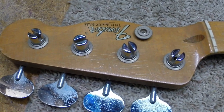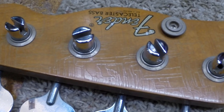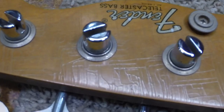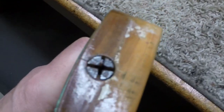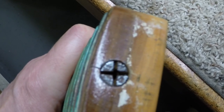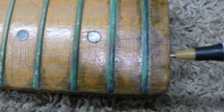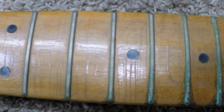I thought I'd get you caught up a little bit on the progress on our Telecaster bass here. I found a bushing from an original Fender in my parts stash — nobody will notice those are not exactly the same, and it's even got a little bit of rust on it. We got our truss rod nut out — it was stuck, had to do a little heating and a few things to get it out, got it loose and freed up, got the rod all cleaned up. Put a couple washers in it as spacers and it's flush at the back again. In the meantime, we've also fixed the crack that was right through here.